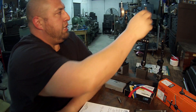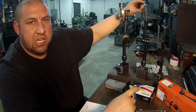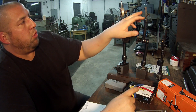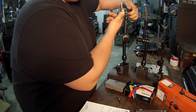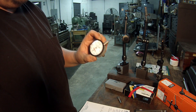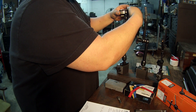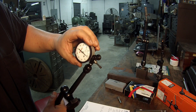All of the ends that hold your indicators come with a dovetail for test indicators, or a 3/8" hole, and you can also get them in 8mm metric. On your standard AGD-style dial indicators, this part of the body is 3/8", and the way they're built you can stick your indicator in here and clamp it — most people actually use it that way.